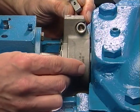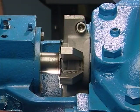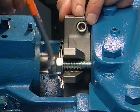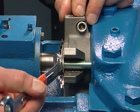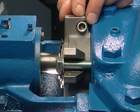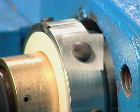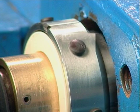Install the adjustable gland tabs as needed for a 2, 3, or 4 bolt pattern. Evenly snug the mounting bolts to the stuffing box keeping the seal perpendicular to the shaft. Do not over tighten the bolts. No centering of the 442 is required — the internal face centering buttons will center the seal automatically.